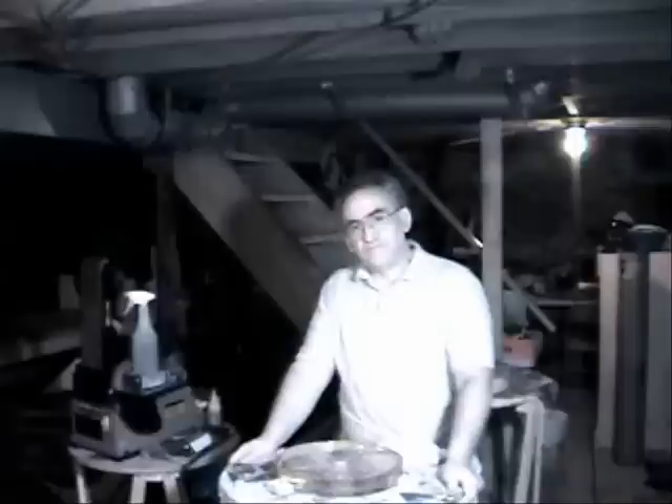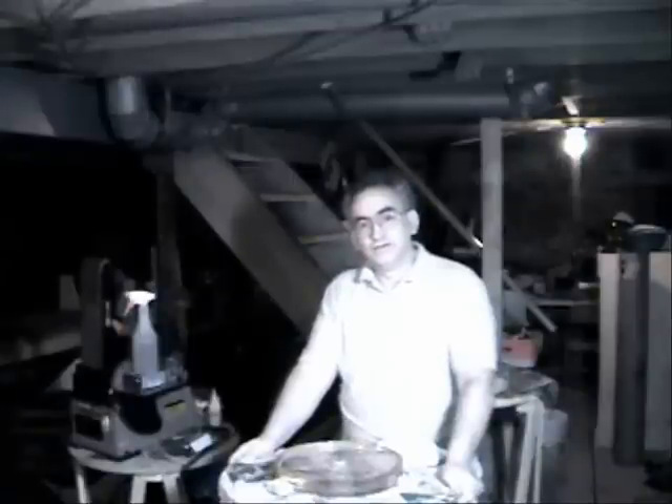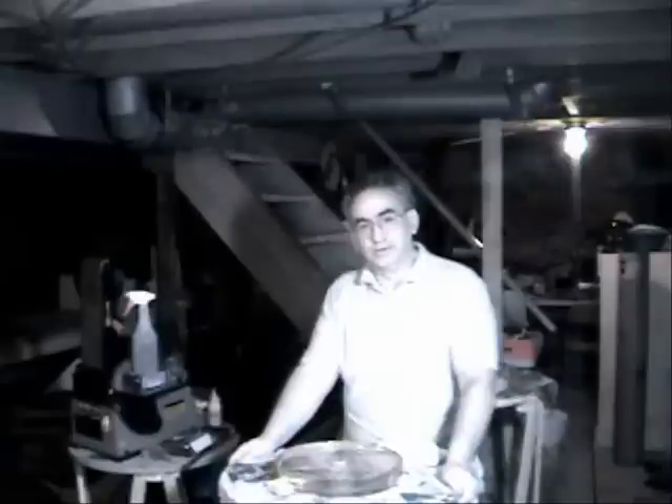I've drilled the hole to within about fifteen thousandths of the primary surface from the back, to relieve the stress while I'm grinding and polishing the flat. Once the flat is finished, I will drill the hole from the front surface to the hole in the back, lining up very carefully with a microscope so that they match exactly when they meet. It's a bit of a tricky operation, but it's important. One thing that will happen once that's done is that the edge around the core will turn up slightly — it will have a bit of power and a bit of radius of curvature. Traditionally that was fixed with hydrofluoric acid, which is very dangerous, but there are new modern chemicals available to repair that turned-up edge. That's it for this edition of the Telescope Makers Workshop. My name is Francis O'Reilly, and this was recorded on Monday, Memorial Day 2012, May 28, 2012. Thanks for watching.